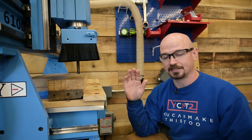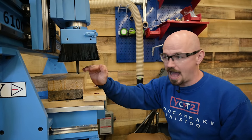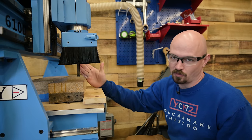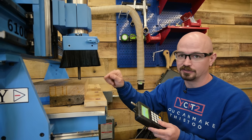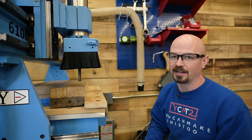To speed up that process, because I have this running really slow, taking really shallow passes, I set my Z high, so it'll actually do an air cut, which is tracing the same pattern, but above the material, so it doesn't cut anything, because if it's wrong, well, you just ruined your material. And I also told it to ignore the feed in the program so I can tell it to run a lot faster than it normally would. So let's make sure it's gonna run right.